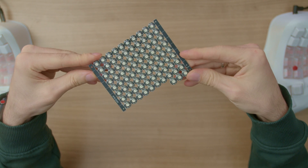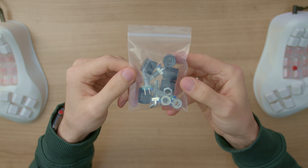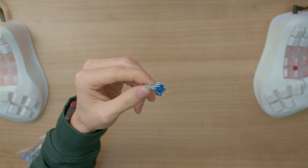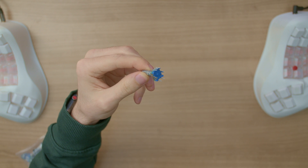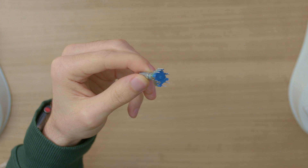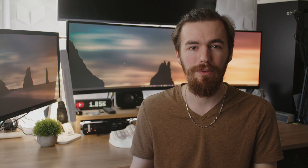I printed a tiny spacer to slot the LEDs in to make the soldering a lot easier. I'm using this pack of 100 WS2812B LEDs that cost around 16 euros. For the rotary encoder I got a 5-pack for 9 euros, even including knobs, but I'll just print my own. The three pins are for the rotation with one ground pin and two data pins connected to the microcontroller. The switch — the two wires on the other side — will just be placed on the matrix with another column added for it, and you also need a diode for this one. I also placed two sheets of paper under the LEDs for some diffusion if you don't want the RGB shadow casting effect, which occurs when just one color on the LED is covered from a specific angle and you get some quite weird-looking shadows.